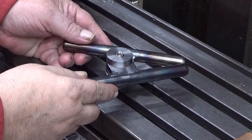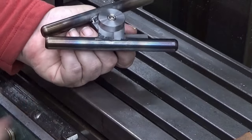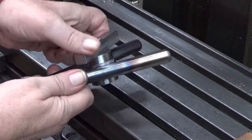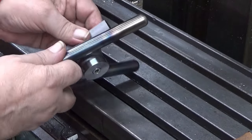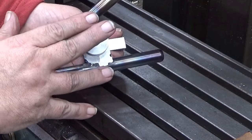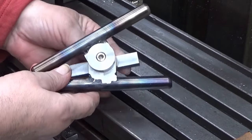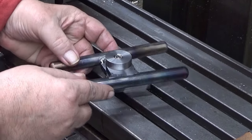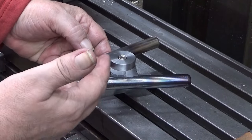So here it is now, deburred, and well, not a beauty, but it works really well. If you rotate this, there is one spot that is not really tight, but it means that it's just in the perfect place. Would it be tighter, it would be too tight. Would it be looser, I don't know when it becomes too loose, but when you put grease in there, which is my intention, then this will be perfect. The grease takes some room there, and it also makes it more stable.